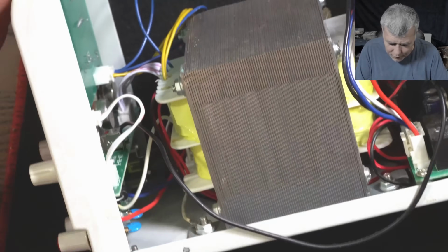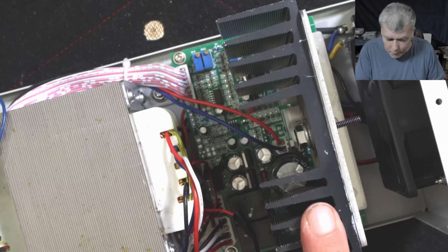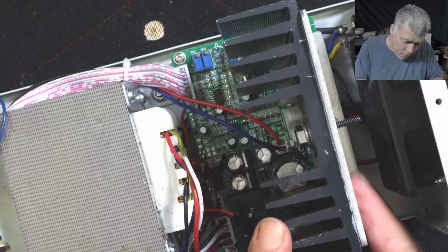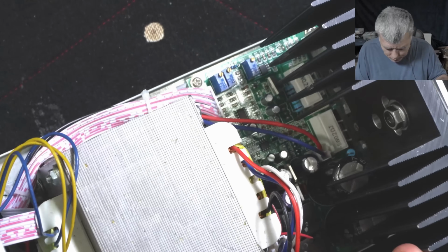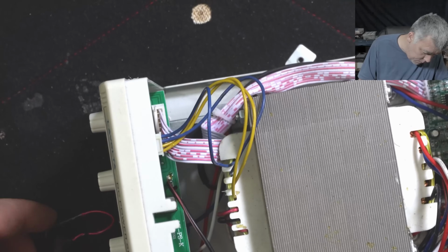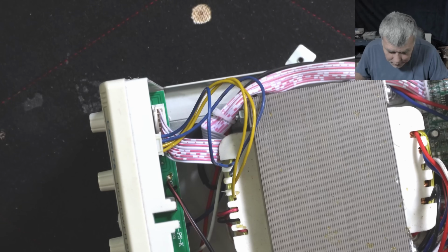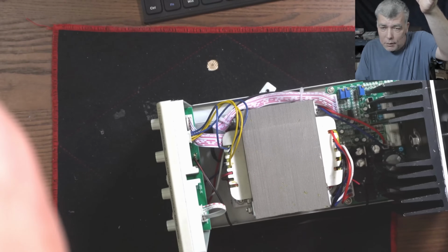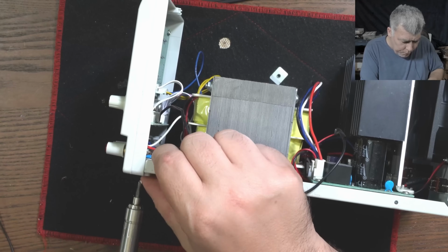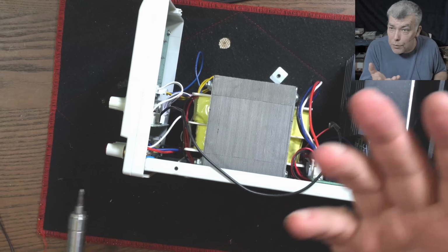Beautiful. But you know what? I never start the fan. I don't need to start the fan because I use this extra heatsink over the original heatsink. So this is doing the job. Now, in order to reach the potentiometers, because somewhere it's losing current, yeah, that's what is happening. We have to take this front out. Let's try to see what's wrong with that potentiometer or adjustable resistor.